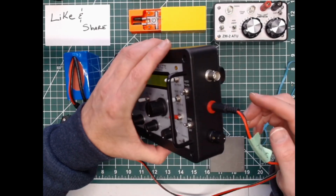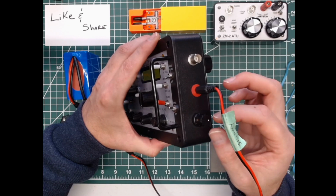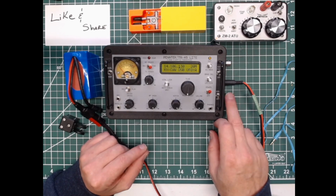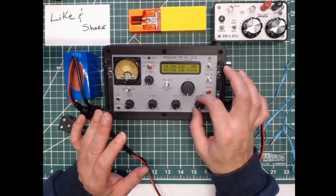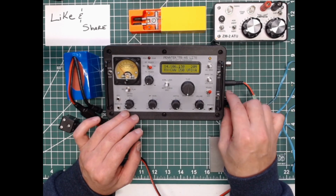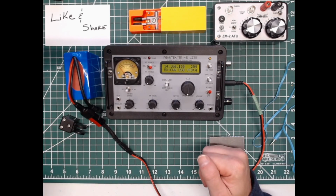And then on the side of the radio, your antenna connection, power connection, this is your CW side tone adjustment knob. Now your side tone is how loud you hear your own key. I love that it's right here on this radio so that when I'm sending, I can reach up and just adjust this knob, because the side tone volume does go with your volume knob. It will go up and down with how loud your volume is, but then you can instantly turn it either back up or down with the side tone adjustment knob. Everything right in front of you. Nothing hidden down inside that radio anywhere.